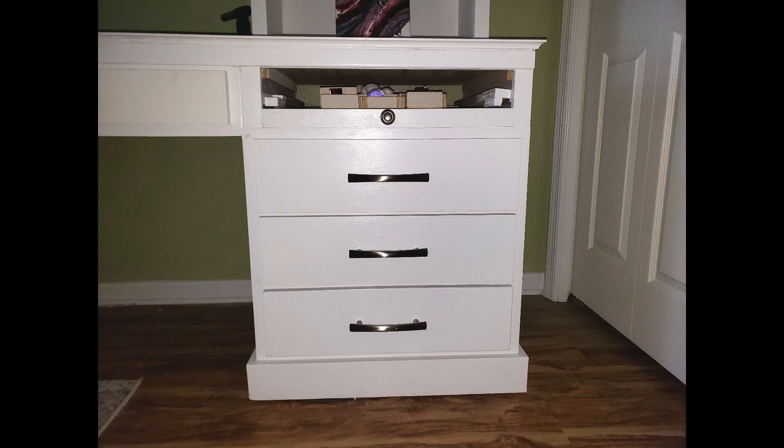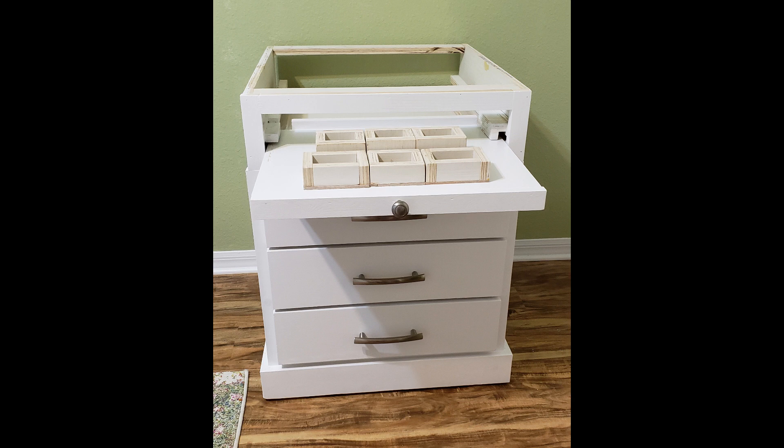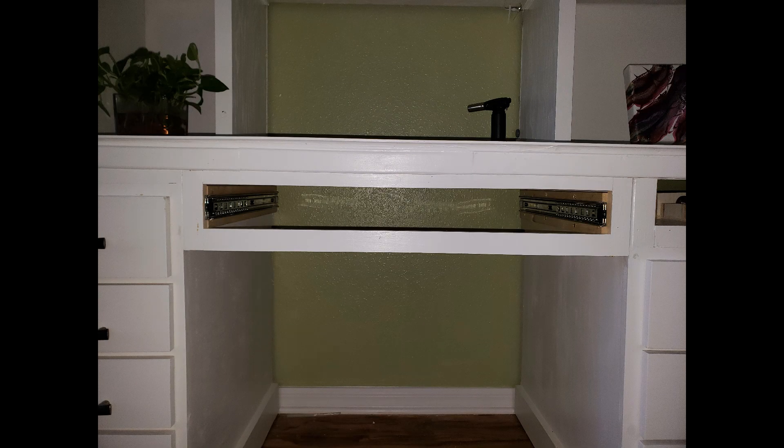The third cabinet has a pullout tray for an additional work area. To guide the pullout tray I made two runners on each side three quarter inches apart so that the tray would slide through. Now that all three are finished, install some round plastic slides on the bottom of the cabinets and equally space each cabinet to allow for the two desks. To make the work area or desk with drawers, be sure you have the cabinets where you want to leave them because we'll be making drawers to fill the void between the cabinets. I brad nailed a 2x4 piece to each side of the cabinets facing into the work area, placing these so that when the facing is attached this section will be flushed with the fronts of the cabinets on either side. Then I made the drawers just as before. Repeat for the second work area.